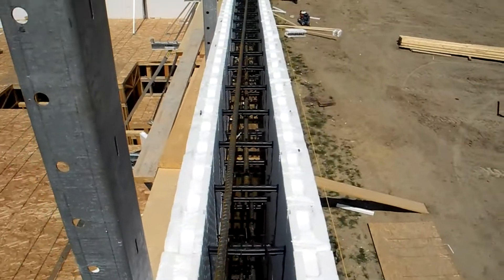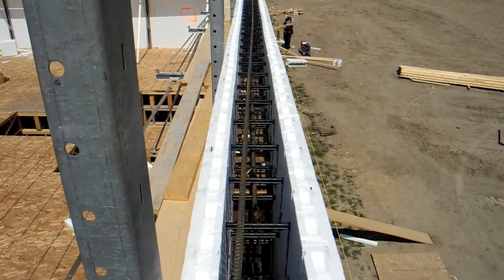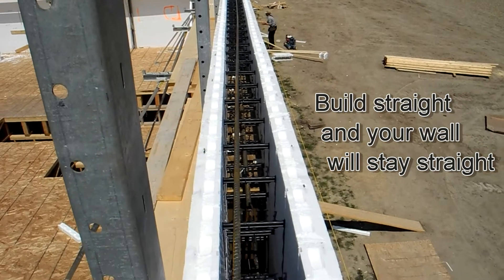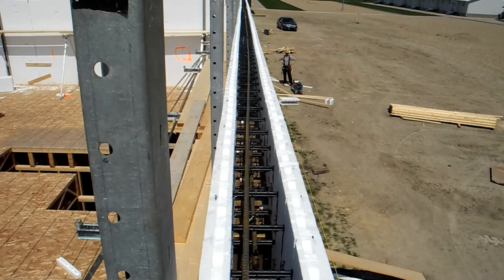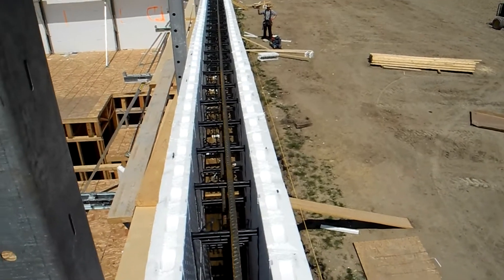But this concerns me even more. On this wall, they've taken their horizontal rebar and jumped from space to space, actually weaving it in the wall. That's going to give a crooked wall — it can be very difficult to straighten a wall like that. It's important to keep the rebar always in the same slot. Don't change it. I'll just lift that up and move it over and it'll be perfect.